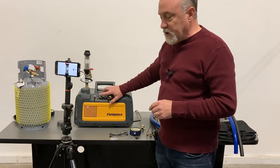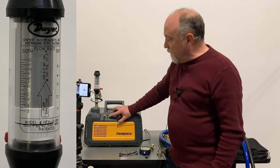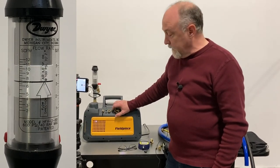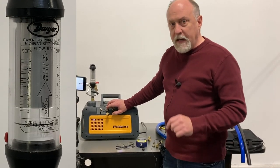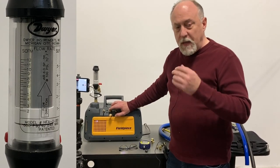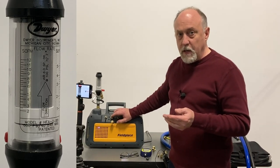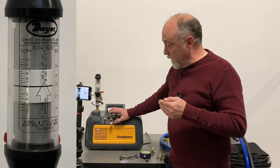But as soon as I put my finger over the port and the atmosphere is blocked off, you can see the flow drops down to about nothing. Back to full flow again, back to no flow again. We do have flow still, but now we're in that transitional or molecular flow region, which is a lot different than the initial degassing we're doing with a big hose.